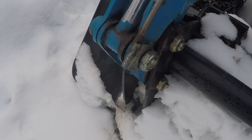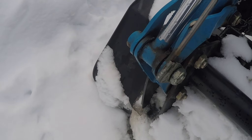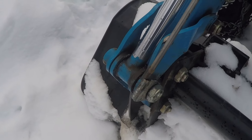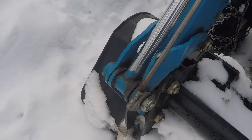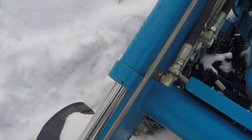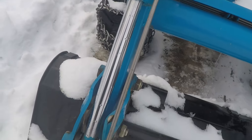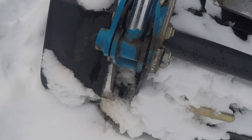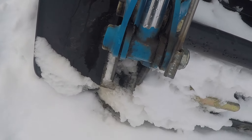Here you can see the original plate. What I did was I just simply ground off the weld that was on the rod. I tried straightening it — heating it up and straightening it — but going through this tube is so tight that I have to get it dead nut straight. I just went to the metal supplier, got some new round stock here, and welded it up, ground it off and welded it up.